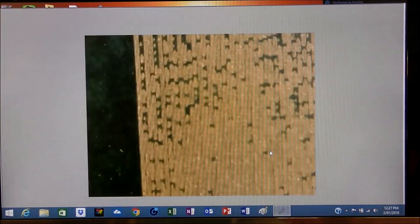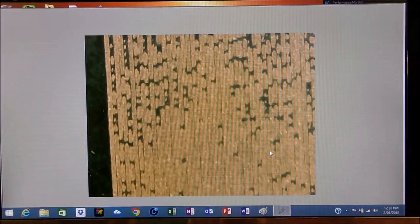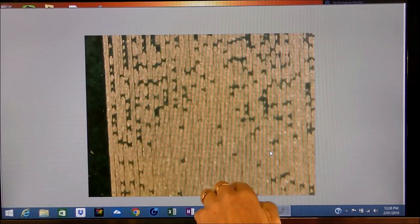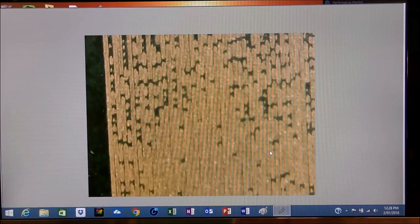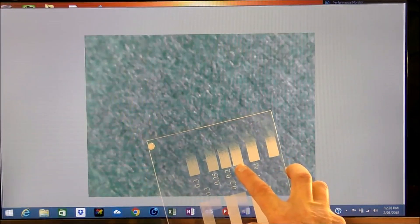This particular one is 0.15mm. Now you can actually detect that there is a very, very small tiny gap. Incidentally, each one of these scan lines of the laser is about the size of a human hair — so the gap in between is a tenth of a human hair. In actual fact, we're looking at that area here, and it's impossible to detect any lines in between, but you can see there is a difference between this and this.